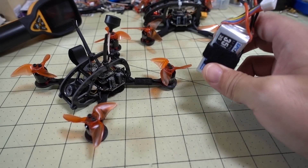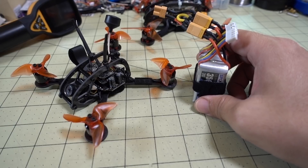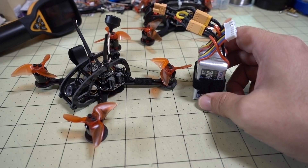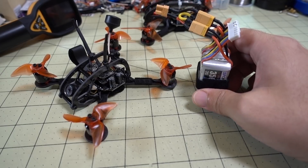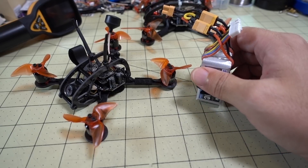Anyway, that's going to do it for this video. Sadly, the motors on this setup are way too hot. I may revisit this little project later down the road with some different motors and see if something else might be viable. But at this point in time, I would say don't bother with 6S on a 3-inch or less, or 2.5-inch or 2-inch micro — it's just not really a viable situation given the kind of motors we have out there and the heat being generated. I hope you found the video helpful and I'll talk to you guys in the next one.